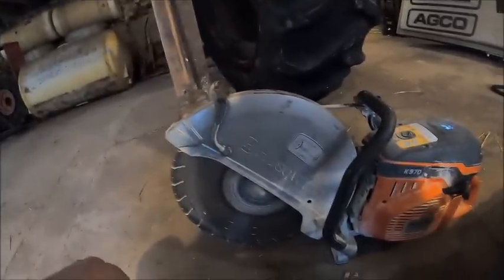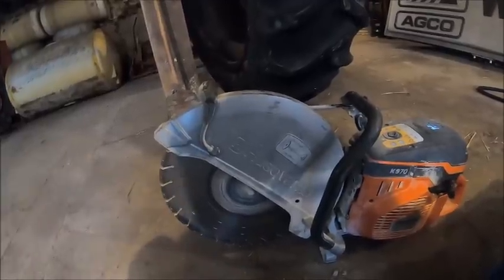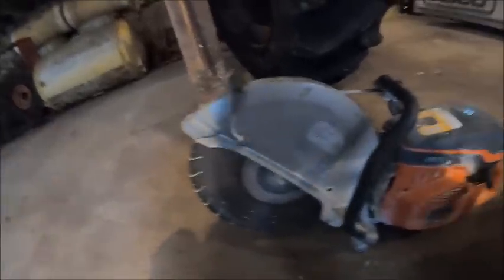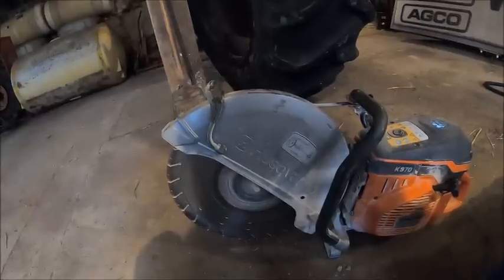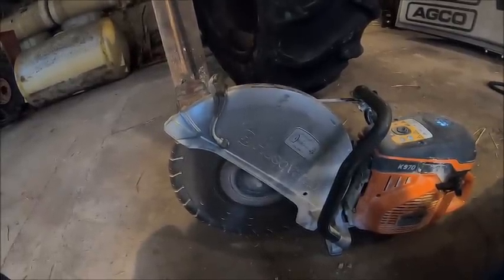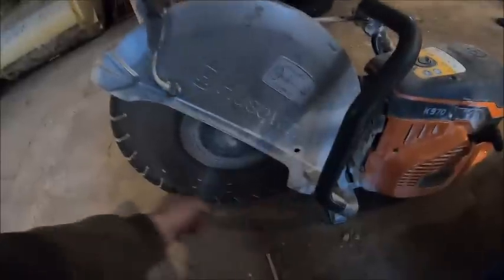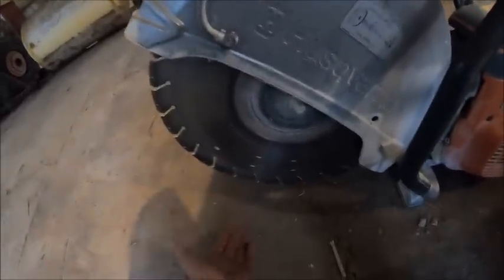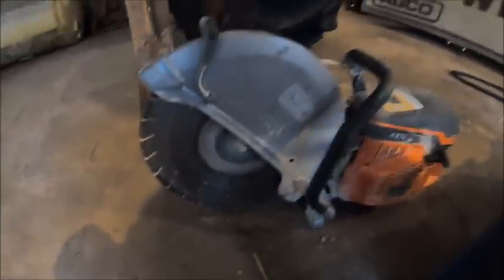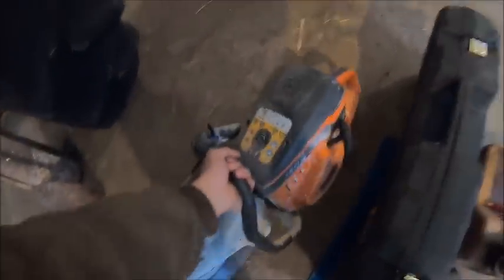And so I was like, well, this is kind of weird. So I went on the internet and did a little digging, and sure enough, every safety video I found on using a concrete saw, you cut off the front of the blade and push forward. So that was a little counterintuitive to me, because of every other saw that you use, like a skill saw, the blade counter rotates, that way it pulls the saw down towards the work. You use a chainsaw, you cut on the bottom of the blade, that way it pulls the saw towards the work. You'd think you'd cut here, that way it would pull the saw towards the work, but that was interesting to me, but if you're gonna use it, you might as well use it right.